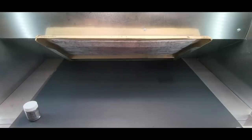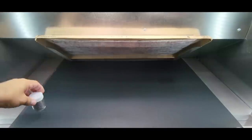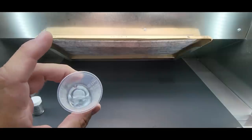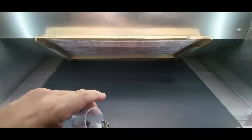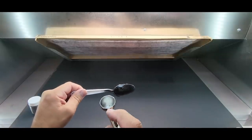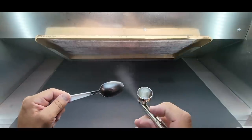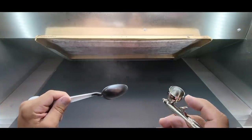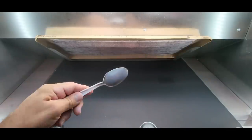Here we are back at the booth. Next up is Nexus Chrome Silver from Finishers. I'll do the other ones off camera, but I'll do one of each brand on camera. You saw how thick it was in the jar — I went 50/50 with lacquer thinner and that's the consistency I have now. Here we go — over black first. It's got a weird metallic look to it as I'm spraying it. Let it dry a little, let's go to the gray — see if we get a different result. Actually it looks the same.